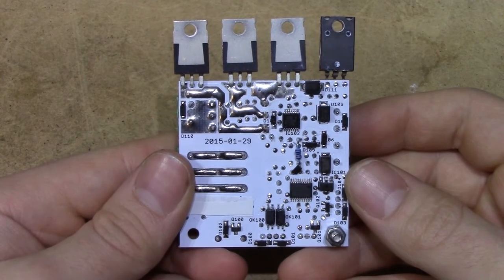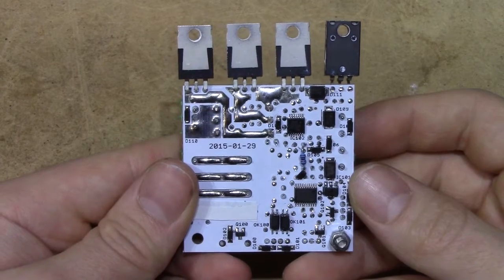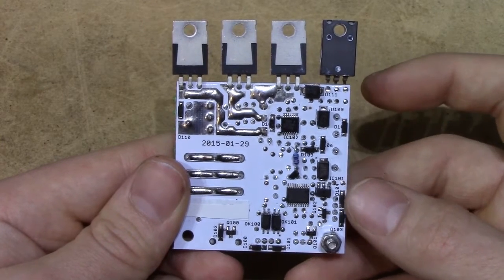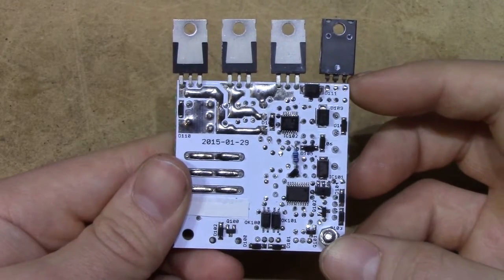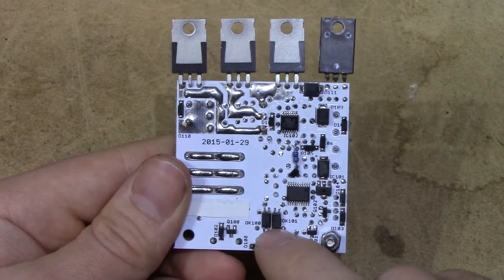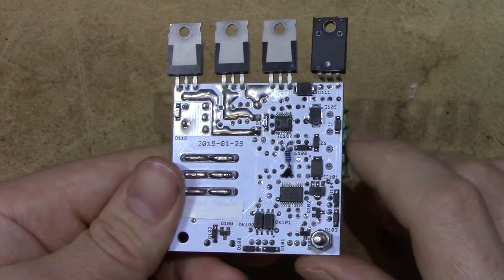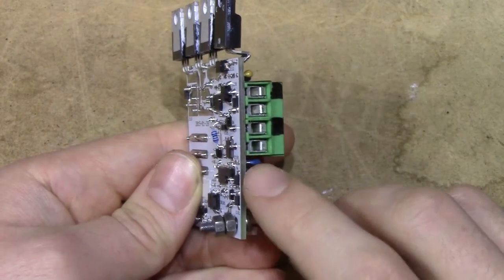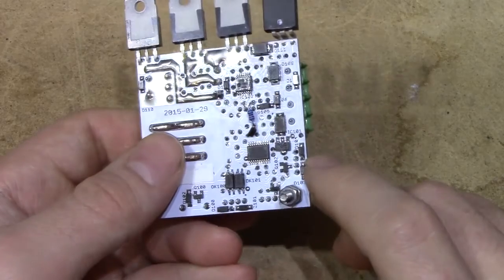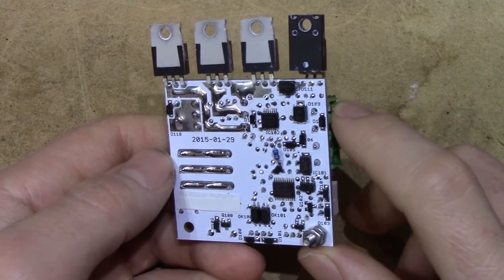Another design requirement was that this device would have to be electrically isolated from the computer it was connected to, as well as from the other loads in the daisy chain. The primary design target was to be able to daisy-chain four of these together to test four devices at the same time. So we also have two opto-couplers, which are just connected to a UART on the processor, providing an optically isolated serial port. We also have an un-isolated serial port with 3.3V levels, which go to the isolated port on the next unit in the chain, allowing all units to be isolated from each other and the computer.